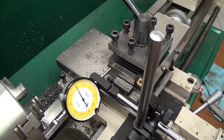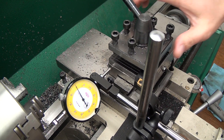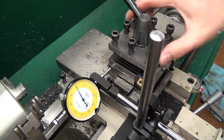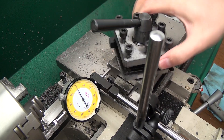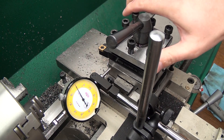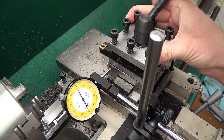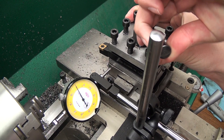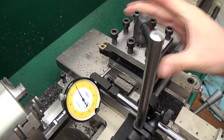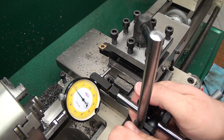The question becomes: if the compound is adequately trammed, is the tool post also adequately trammed? The answer is it is not. From the first time I started using my lathe up until today, I've always just applied pressure in the clockwise position before locking down the tool post, and you can clearly see that the tool post face is not parallel with the compound face.